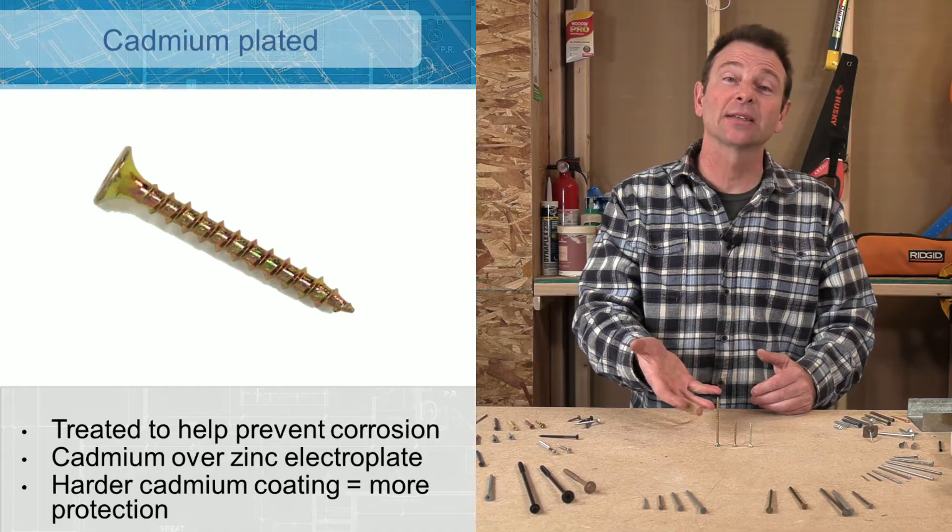I have one more example — I've got some metal stud framing here. This is an example of a metal-to-metal connection: two very hard, thin materials that need to be connected. What I've used for this connection is a truss head screw. This is a very short screw with a very wide head, and it sits very flat on the material. We're going to be adding things like drywall to the outside, so we don't need a tall head that will get in the way. These screws tend to be very short, they have that piercing tip, and that's what's going to connect these two very difficult materials to work with and hold them together really well.